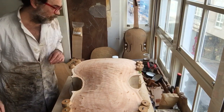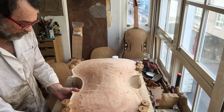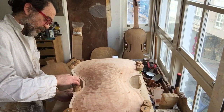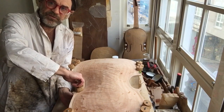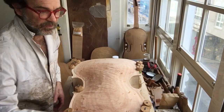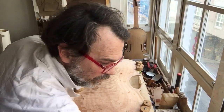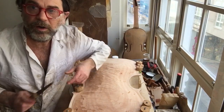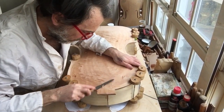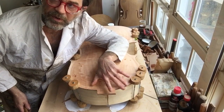For this part I use completely different tools. I clamp my ribs so they don't move. I have a pencil line on the other side where the ribs are attached. Very importantly, I have locating pins — locating pins are your friend. Some makers say they don't like them; I love locating pins. They go through the plate and into the top block so nothing can move.